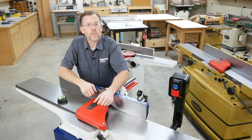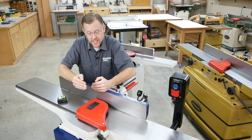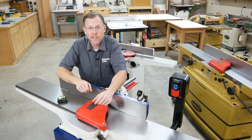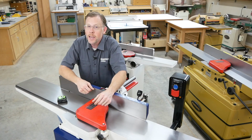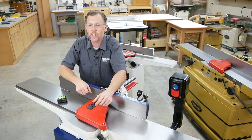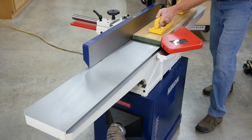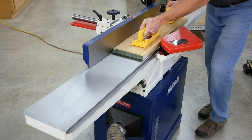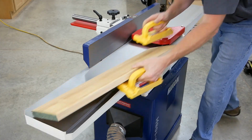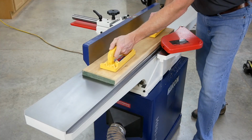Now, you can buy jointers with 6, 8, 10, 12, and even 16-inch long cutter heads. And wouldn't it be great to have the biggest size? But you're going to have deep pockets for that, because you can easily spend $4,000 or more on a 12-inch jointer and $7,000 for a 16-inch model. But over the years, and after owning a couple of different jointers, I've been very happy with an 8-inch machine, and so are many hobbyist woodworkers. It offers a good compromise of capacity versus cost.